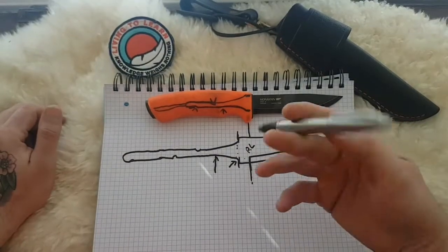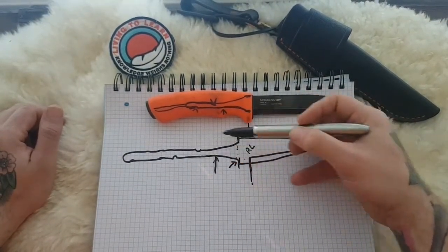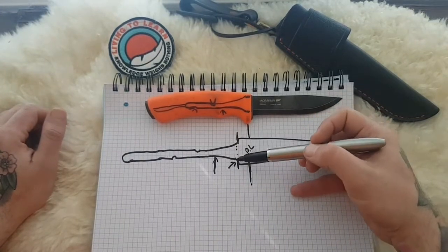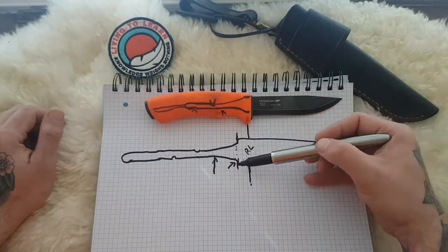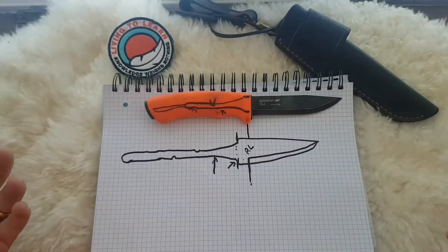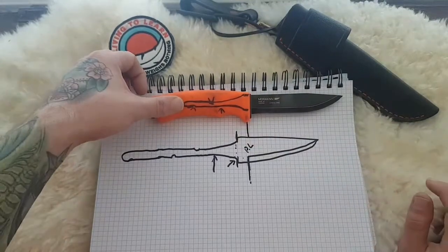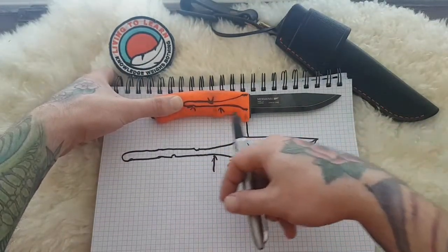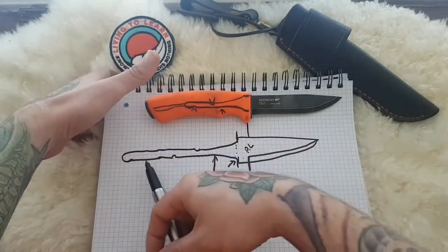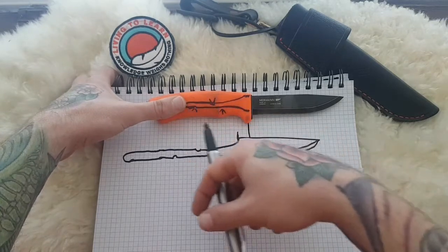So that takes care of this weak point, pushing it down into the handle, and their blanks are the same. So when you're making one as a blank, it keeps the weak point down in the handle and gives you the strength of the 2 and 5 mil drops that you see custom makers using. Now, most of the Mora blanks, you can see, I'll just put my thumb over here, when I get the x-ray pictures, don't come like this. They have this extended bit on the end, which again is crudely illustrated here. Most Mora handles just look like this.